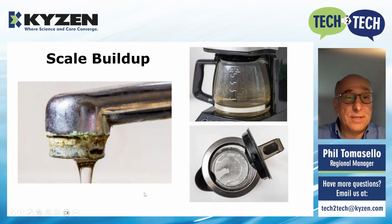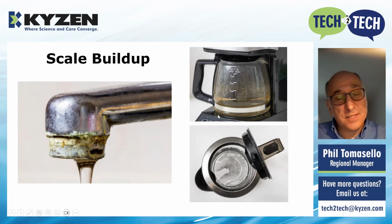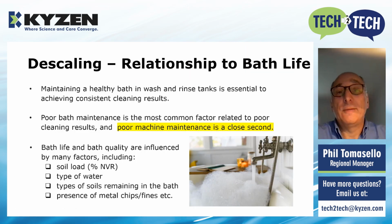There are great examples here, great photos. Scale buildup. Go to an old faucet that you have. Everyone's got one in their house somewhere, and you're going to see that mineral buildup. You'll see that scale. Same thing with coffee pots. Every coffee pot needs to be descaled over time. Why? It doesn't work as well. It's not flowing as fast. Scale is lining the inside of that coffee pot and making it tough to get good coffee out. It's working slowly and inefficiently. We all see this, right? Same thing with aqueous parts washers. Descaling is very important, has a significant relationship to bath life.